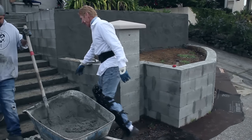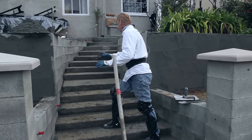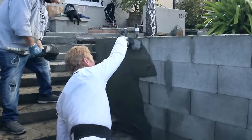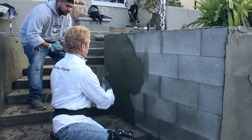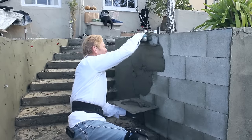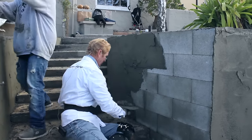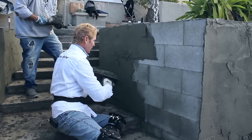I'm not worried about getting mud on these stairs because they have two-inch flagstone going on them, so after we get all this done we just take a trowel and trim it right out — it's all going to be covered. On a radius wall, do you have to trowel it out of radius? Not really, because it's such a large radius. I just take it the same as I did on the other side. By the way, a lot of people who've watched us over the last ten years ask: Kirk, how come you don't wear knee pads?